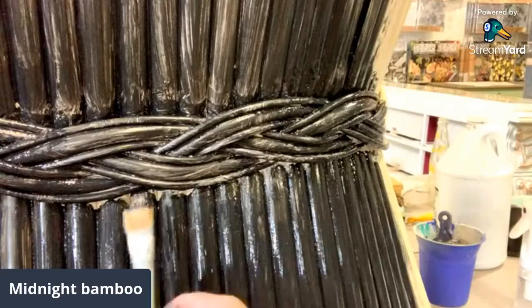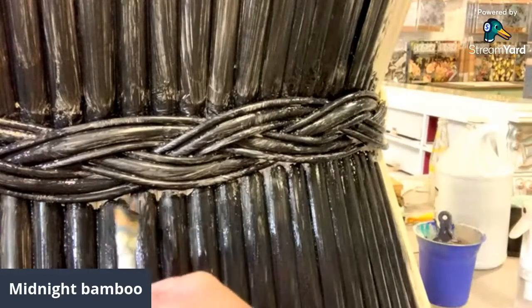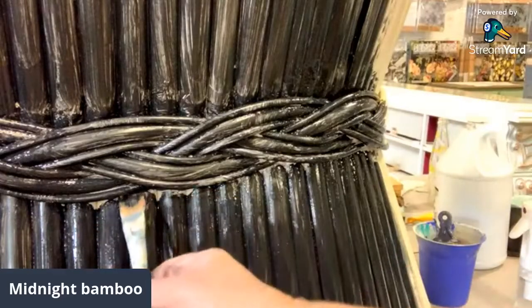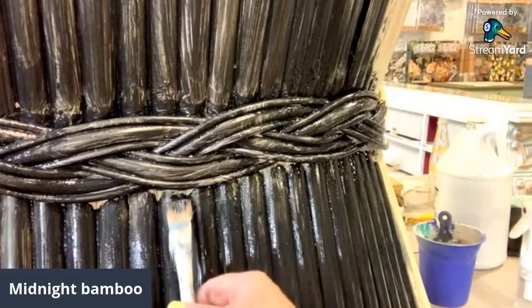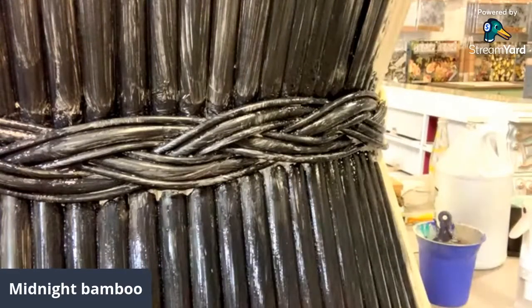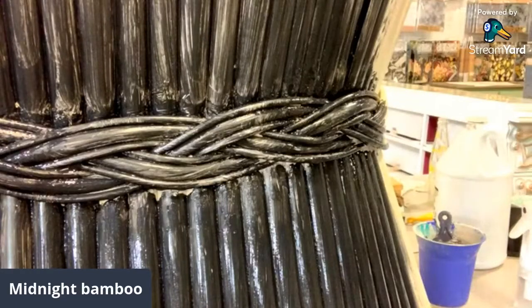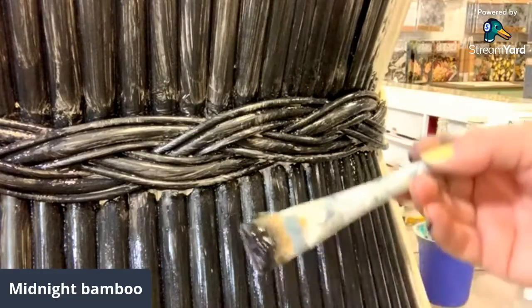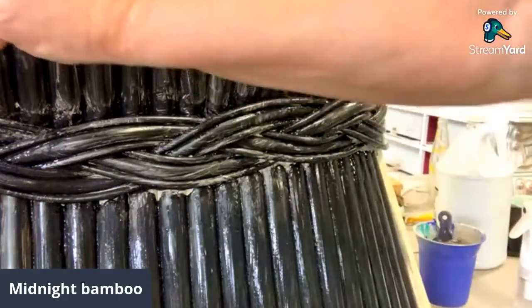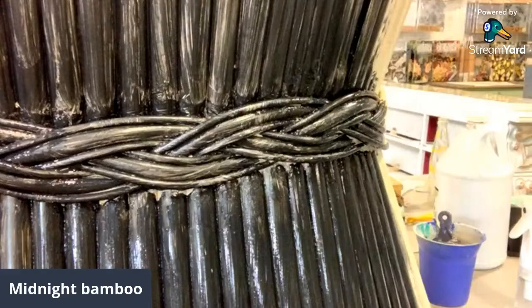I'm going to pull the water that just dripped down, and I'm going to make sure that I don't leave that ridge there to dry, because once it's dry, it'll look terrible. It won't look like a good professional paint job. And that is a handy little tip so that you don't have goopy spots or you don't pull your paint off prematurely. And this is the size brush that we'll use to go back in and squish paint down into the grooves where we need to once it's good and dry.